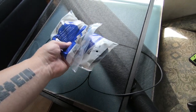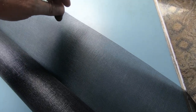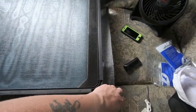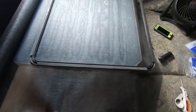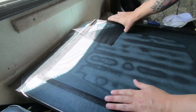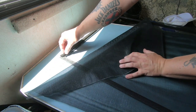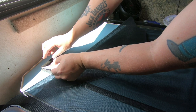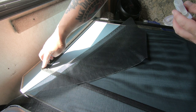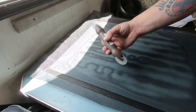I'm not going to save the old splines even though they don't look that bad — the weather and sun make them brittle. I got two more bags of spline to start over. Make sure you have the right size because there are about three sizes. Here's the old screen — you can see how big the holes are — and here's the new one, it's hard to even see through to the table. I'll line this up leaving at least an inch and a half around the corners, place it over the grooves, and also inspect this piece of foam that protects the gap — it's coming off, so I'll put some super glue on that. Then I'll run the spline in here to start. You will need one of these spline roller installer tools.